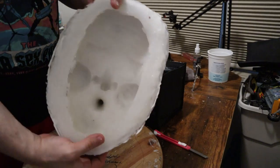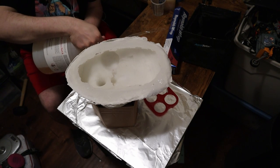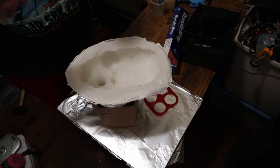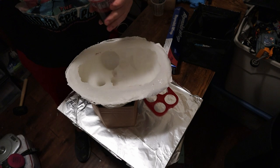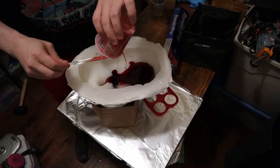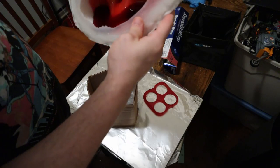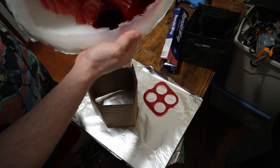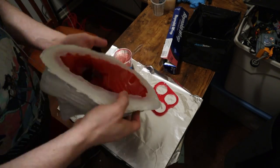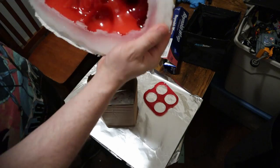The mold is ready. We are casting urethane resin — it's going to be multiple slosh coats, usually two or three, maybe three or four. This first one is usually a throwaway — you're doing it to get some of the clean-out out of the way. There was not a lot of grody stuff to pull out of the mold, which was super cool. I have some blood-red clear resin. It's old resin, and I wasn't expecting this cast to necessarily be great — but let's just say I get a little bit lucky sometimes.